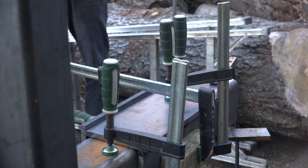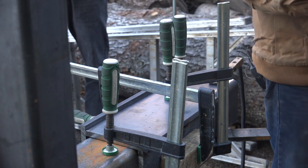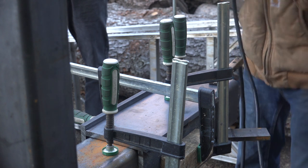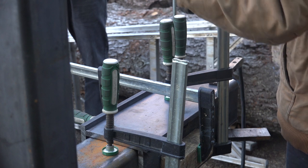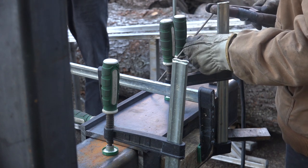It's important to hit the metal and then come away really quickly, or when you just hit the metal you just have to be prepared. It depends on these. When they're already started, they're a lot easier to get the arc going. You can just literally come in relatively close and start. On the new ones, they're harder to start, so you actually have to scratch the surface a little bit and get the arc going.